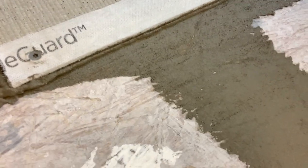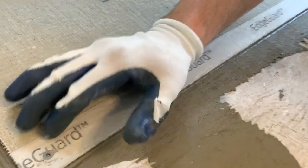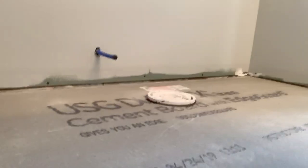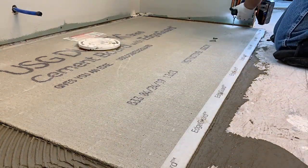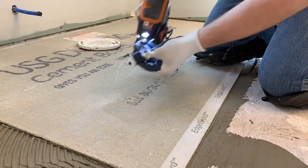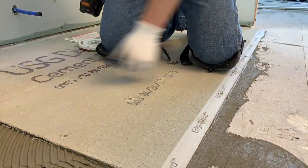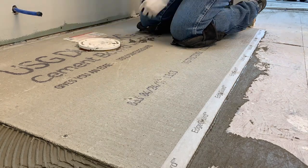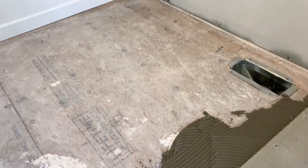You'll just want to try to put the screws down flush with the cement board. I like putting screws in the seam like this because the tape will cover them up. Another method you could do is screw around the edges first without screwing the field of the backer board, put it all down, then come back through before your thinset sets up and screw it all down in the field. It's whatever you prefer.